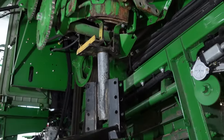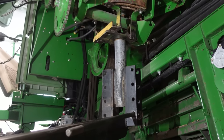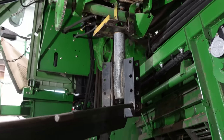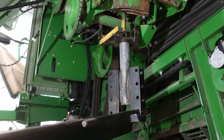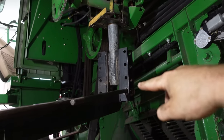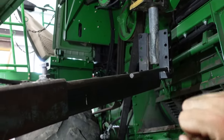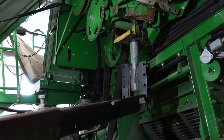We've got a fixture here that one of our older techs a long time ago made for pulling verticals. This little rig here has been around since Moby was a minnow. It's been around the shop for a long time, but it works. So there's a pipe sticking out of this piece, slides into this piece that bolts on to the end of the cherry picker, and then you got a rod hanging out, which is handy because you can slide a cheater bar on there and give you some leverage back out here to where you can control this gear case and auger.